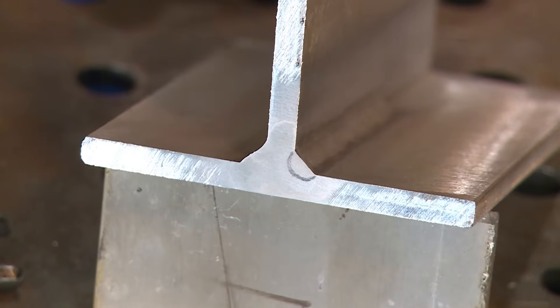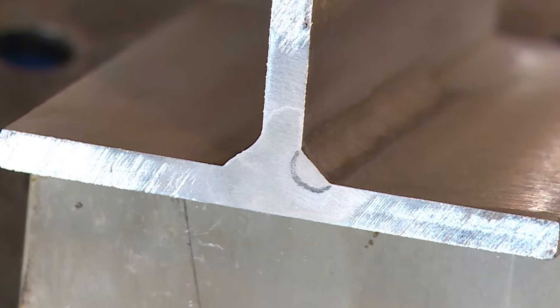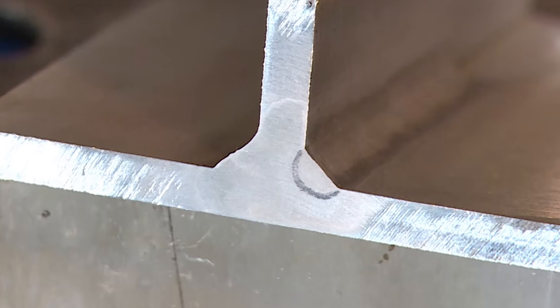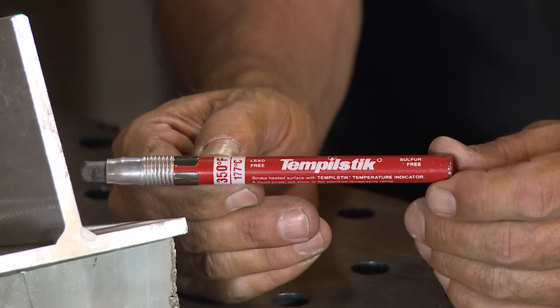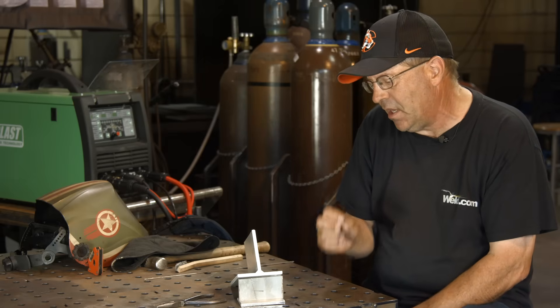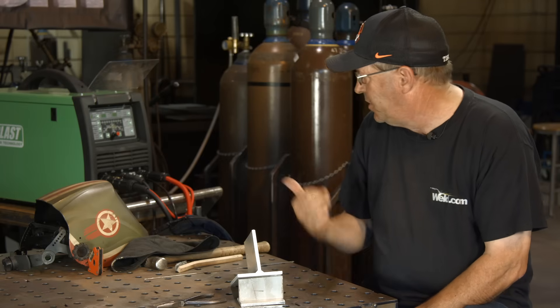If you can see this, I put a light pencil mark around it. When we cut this and hit it with a die grinder and a 3M wheel and buffed it a little bit, when you got the light just right you could see the grain structure — though I realize it's hard to see on camera. A couple of things going on here with the nature of aluminum. If you preheated it — here's your temp stick, this one's at 350 — if I heated this up to about 350 and made this exact same weld at 180 amps, I would probably get more depth. You can control the width and height of the bead with travel speed and the amount of wire you dab in. Don't be scared of a DC machine.